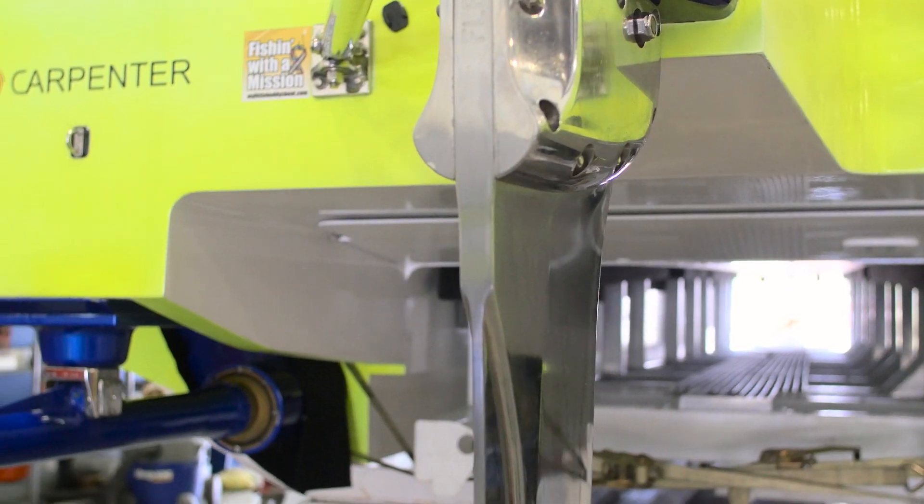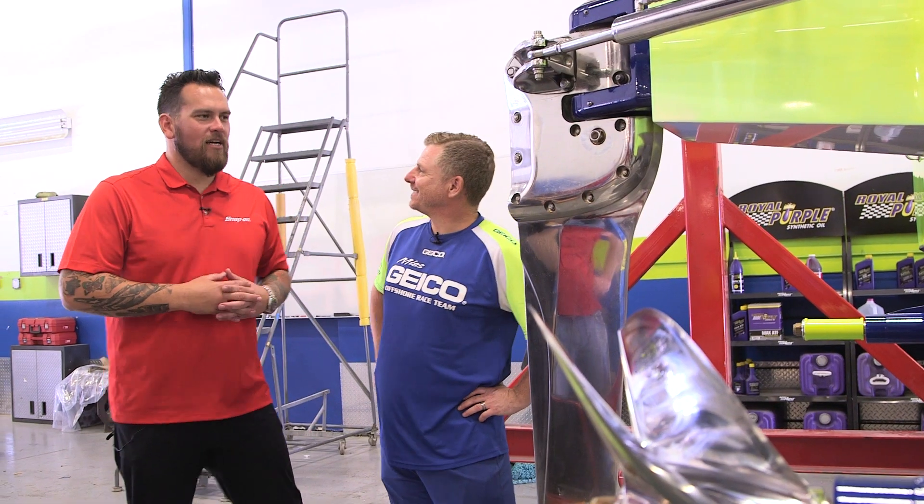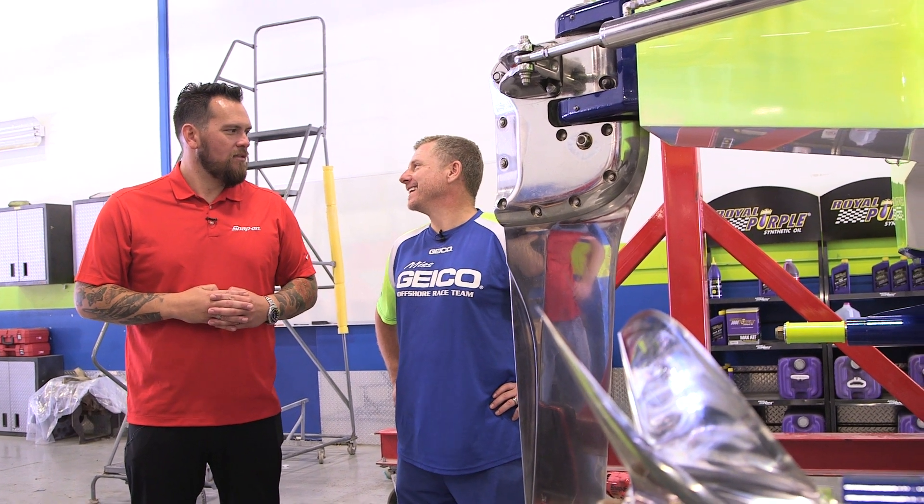At the business end of the boat with a prop on, at full speed all they want is half a propeller in the water and about six inches of rudder. So they're more on air than on water. On land the boat weighs 12,000 to 12,500 pounds, but when running at those speeds it's effectively only 600 to 900 pounds. In car racing you want downforce; in boat racing, you want the opposite — upforce.